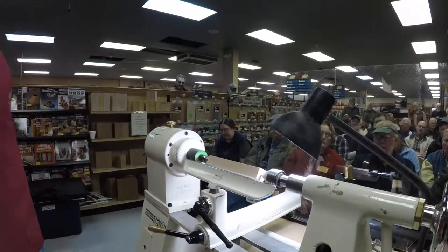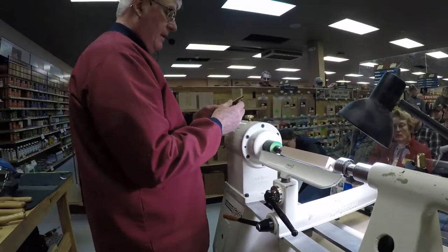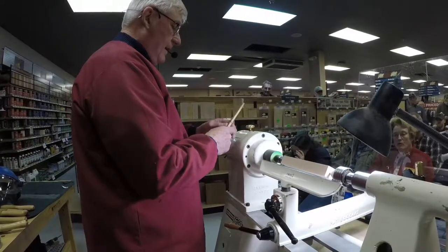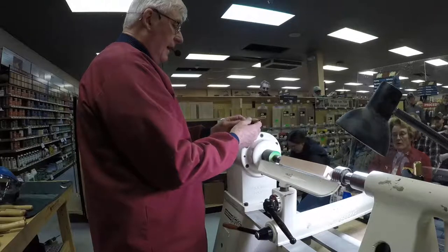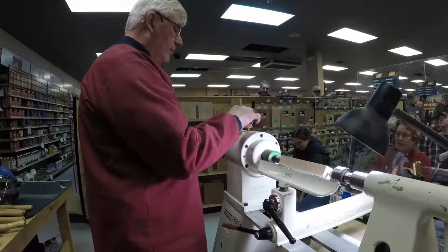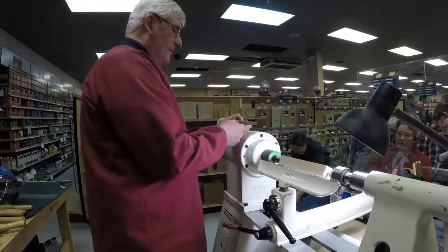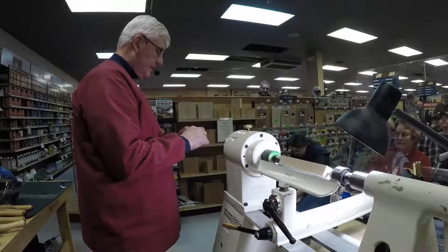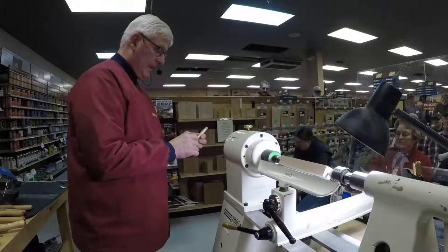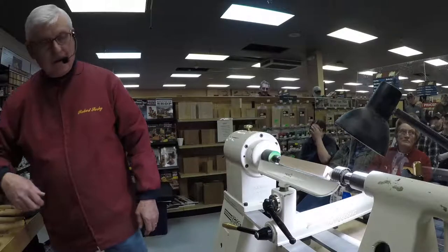I've made about seven of these now. And this one I did with a combination of glued pieces together. When I drilled it, I think it didn't like going through the center where the glue was. It went out through right over here. So as I get down to the end, I mixed up some sawdust and glue and pasted it in there, and fixed it in. It looks fairly good. If I hadn't told you, you might not find it right away. Designing opportunity.